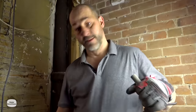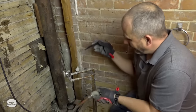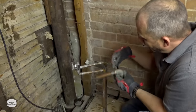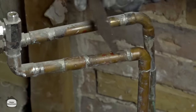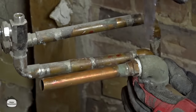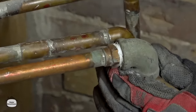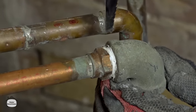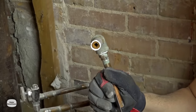The old steel lines have a life expectancy — they will not last forever. So if you're renovating and you run into them, do everything you can to update those lines. Now people at home are going to ask: how do I know if I have steel lines in my house? If you can see your line going into your wall and you see a copper-to-copper joint — it's very thin, very clean, a solder joint — that's all copper. A steel pipe connection is a much bigger pipe and you'll see a nut-type piece of copper that's soldered to the pipe and then threaded in. That is a very distinctive look, and if you have that coming out of your wall then you have a steel supply line inside — and the inside of your line looks like what we just showed you.